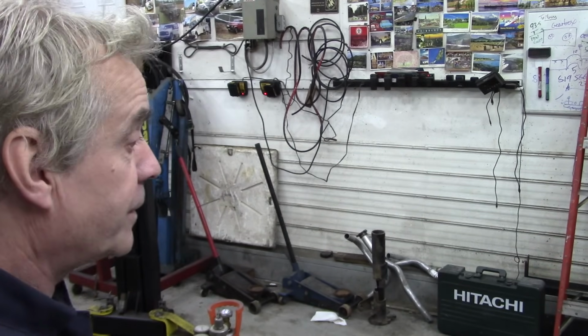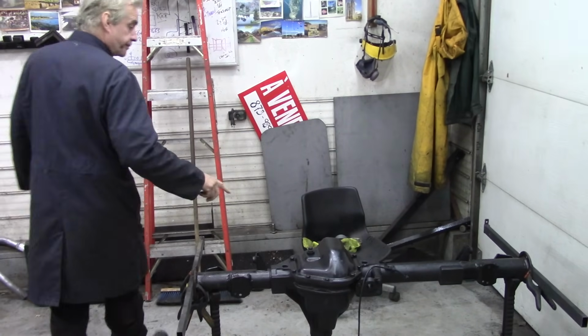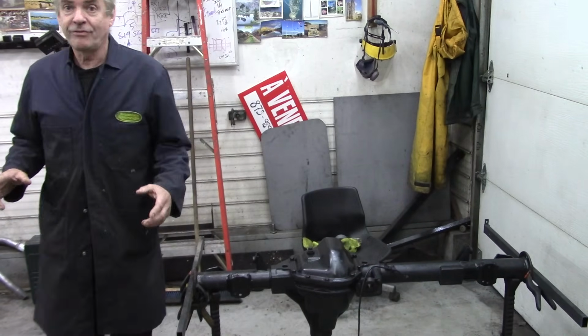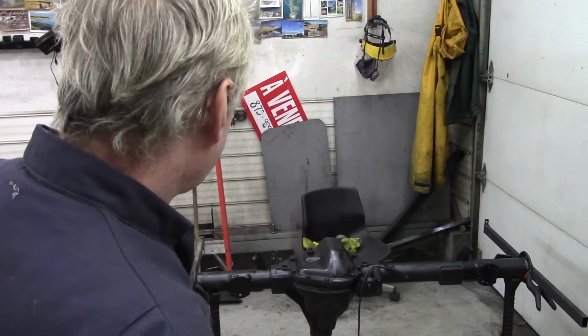Anyway, when we go back to this axle here, we're going to heat the underside here. We're going to heat this bit, and then we're going to quench it. By doing that, hopefully it will quench the other way and pull that round so it's parallel. Now remember, because we're 8mm out at the extremity, we only want to pull it 4mm. Now that ain't much at all. But remember, that's at the extremities, so by the time we get to the flanges, we may be only taking 1mm. It's not much.